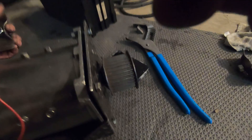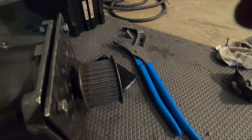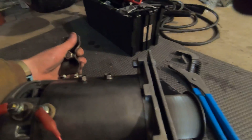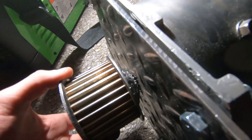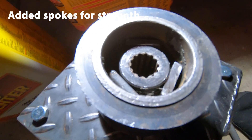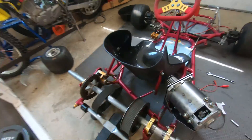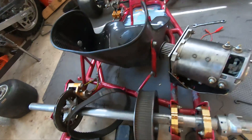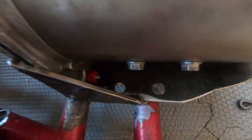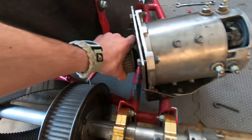This is it on the motor — let's see how balanced it is. It does wobble a tiny bit, but only about half a mil up and half a mil down, so it should be fine. I just welded this and then put it on. We're all the way on — pretty good. I got the pulley on, the belts are on, and I re-drilled those holes so I can mount this farther over to the right so it lines up with the pulley. Now I just gotta mount the motor to finish the drivetrain.